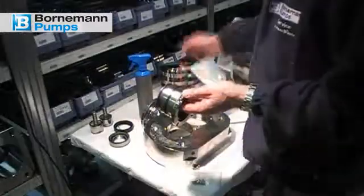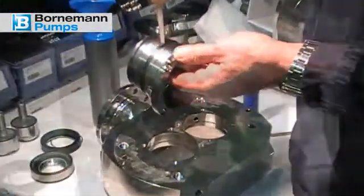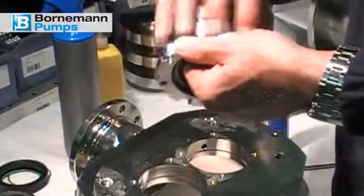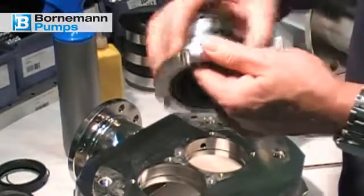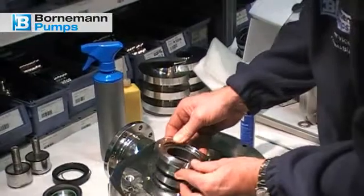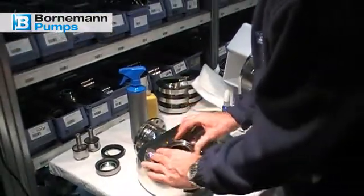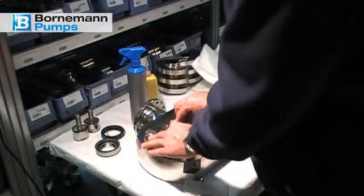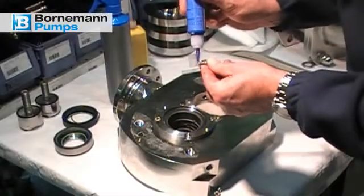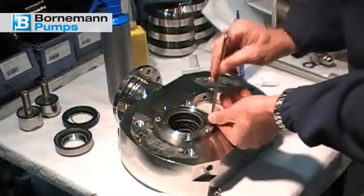Apply a drop of food-grade oil to the o-ring and the form ring of the cartridge unit and rub the oil on the rings. Place the unit left or right into the intermediate flange — both directions are possible. Press the unit over the o-rings and correct the position if necessary. Coat each fastening screw with a drop of blue Loctite before putting them into place.